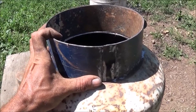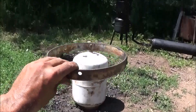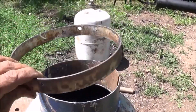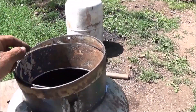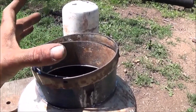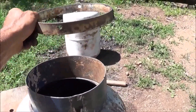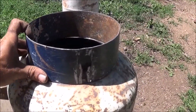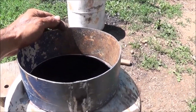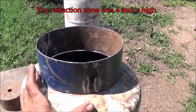Our reduction zone is going to weld right onto the upper container, and this ring that I measured to make sure it could slide inside of, is going to weld onto the top of that tank back there. That'll give us that seal. We'll use the ring from the bottom of that tank to go around the two of these. That should give us a nice gravity-based seal as the upper mass sits down on the lower ash catch and seals it all together. I'll show you the oven stove door rope that we put inside of that. Right now, what I've got to do is go ahead and weld this onto there, get it centered, and like the last one I showed you, I'm going to make a screen for right here that can open and shut with the cable on there so we can do the ash dump.